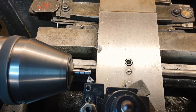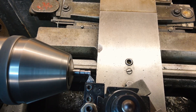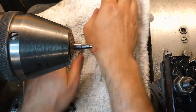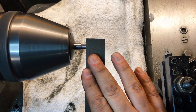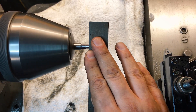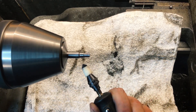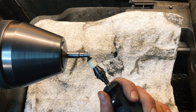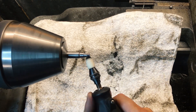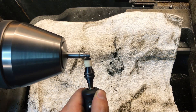Because the screw has such a long part that's not threaded, I had previously turned down a little spacer piece out of scrap. You can see it here with the little step in it. It serves to support the screw, but also the smaller part of the step is the desired head size of the screw. Once I have the screw head to size, I'm using a flat piece of steel with sprayed-on emery adhesive on one side and 1000 grit sandpaper on the other. The little step on the spacer gives me enough room to really keep the sanding square to the sides, so I don't run the risk of rounding over the corners. Once the screw head is sanded down, I'm going to deploy the Dremel to do some final polishing. The lathe is running backwards so it's going in the opposite direction of the Dremel tip. I have some diamond paste and I'm going to go through a couple different grits: 5 micron, 2.5, and finally quarter micron. I buy these felt polishing tips off eBay in bulk and I pair each tip with a grit so I don't cross-contaminate.